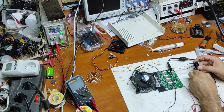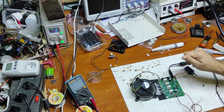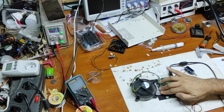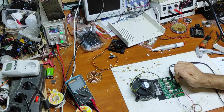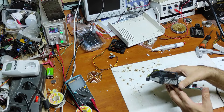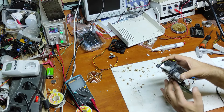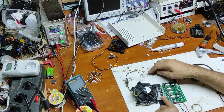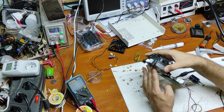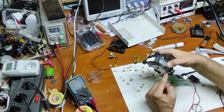I adjusted to one amp — it's much better but still very warm. This kit should handle 150 watts but now at 25 watts it's already very warm. I have to find a better solution. Here near the transistors it's very hot and here at the heat sink fins it's very cold.